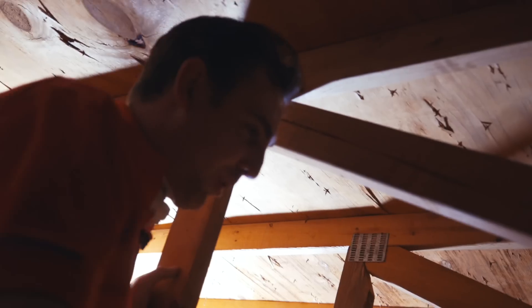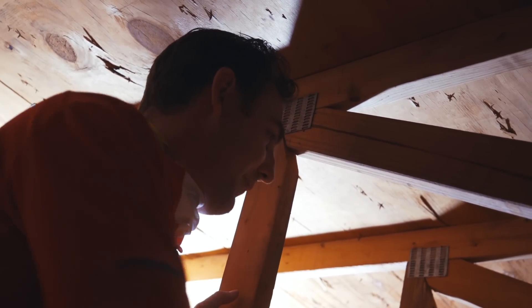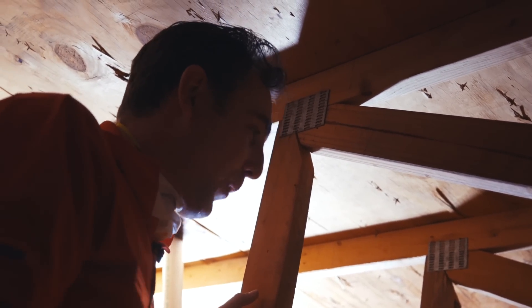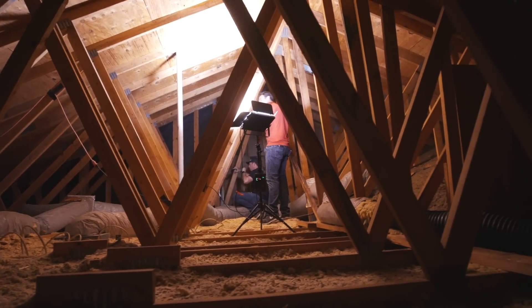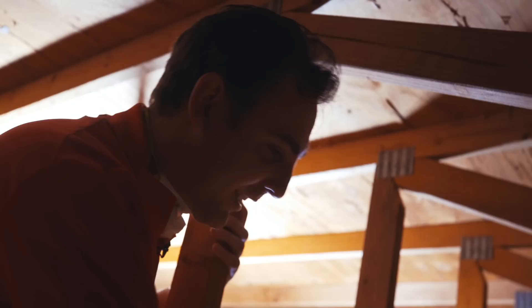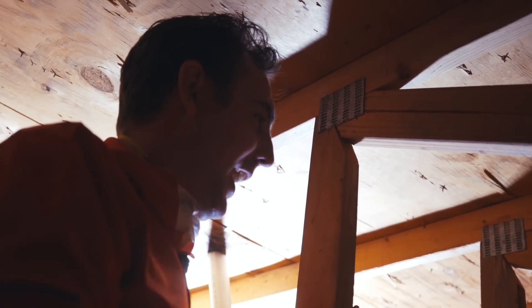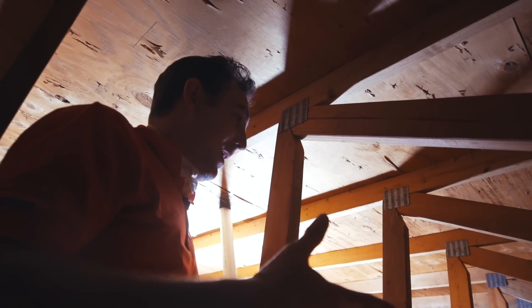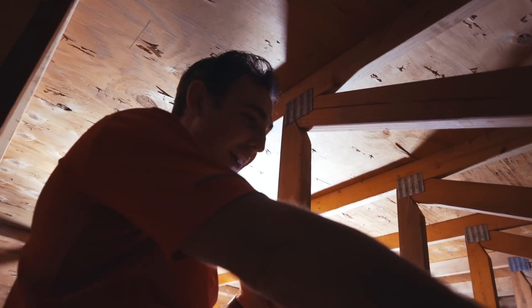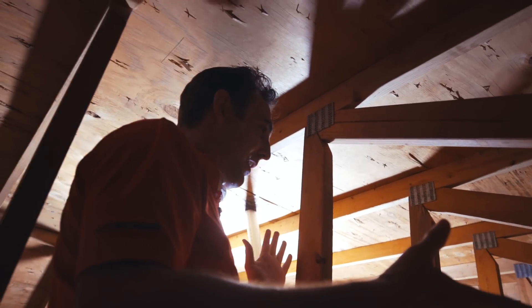The air moving through here is 500 to 700 feet per minute — really fast — which is how they got away with such thin layers of insulation. But code for the attic is R38, like 19 inches of insulation, whereas on your duct work there's only about an inch. And when you consider 55-degree air inside versus 140-degree temperature out here — that's a huge delta.